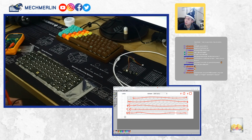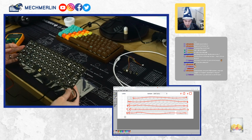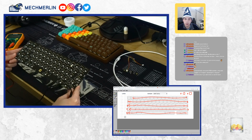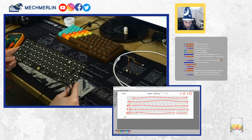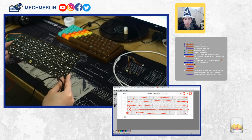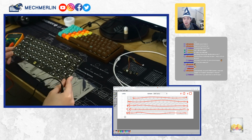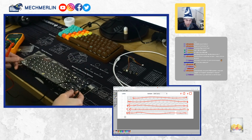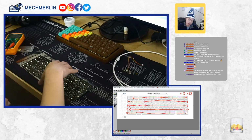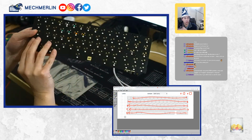Mac asks, since this PCB is broken, what will happen to it? Repair, send back, or e-recycle? I'm actually going to try and repair it. All of the Christmas light LEDs, I think that's happening because of the broken LED. I might just need to reflow it, either the RGB LED or the controller chip. If that works, great, but if not, 80 Ultraman will hopefully send me a replacement PCB,